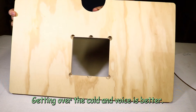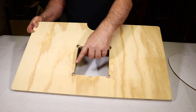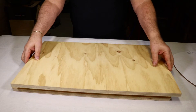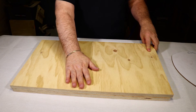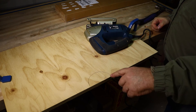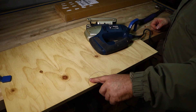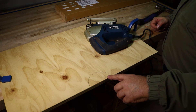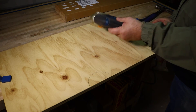I'll take the other board that I'm going to put on the bottom and size it up to match the top, then cut out the clearance area for the drill press post. I'm going to rough cut this opening — I won't sand up to the line. Once I glue the top and bottom boards together I'll use a flush trim bit on the router to go around that and around the other corners to make sure it's all equal. Just cut this out roughly for now.